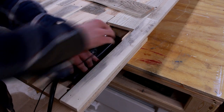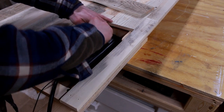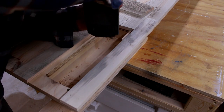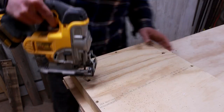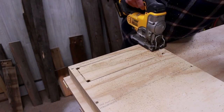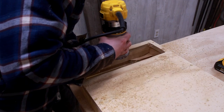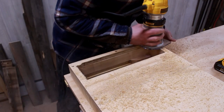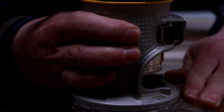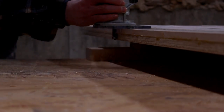Now onto the power strip compartment. I noticed it was going to be too shallow and I needed to give it more depth. I drilled out four holes in each corner from the inside, flipped the table over, and then used my jigsaw to connect the holes. I made sure to leave an overhang again so I could clean up the edges with my flush trim bit. Since I had my palm router out I cleaned up the tabletop edges and made them flush with the plywood.